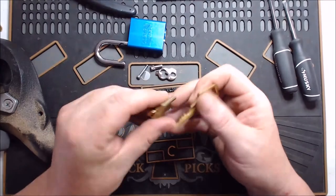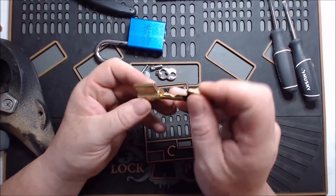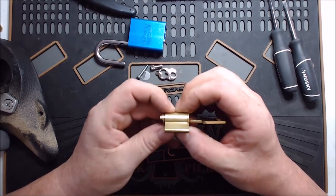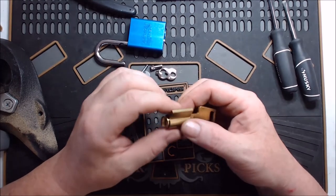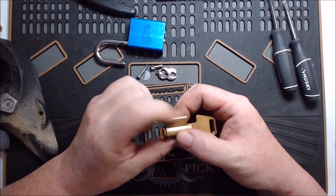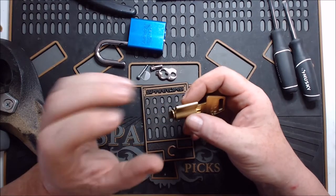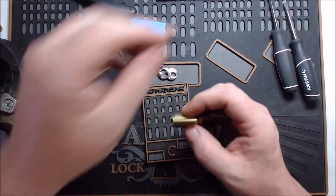Once you get the C-ring off, the lock core is not going to come out right away because it's locked. So you put the key in. Most locks I try to turn just barely past the shear line and no further than that, especially if it's a lock I've never opened before. Because what will end up happening is that if there are other recesses inside the core — like a construction hole for a construction lock — the driver pins can actually fall down inside them, and you'll never be able to get the lock open again.